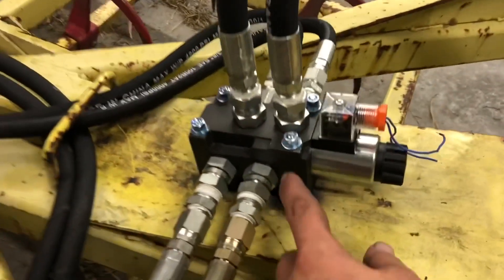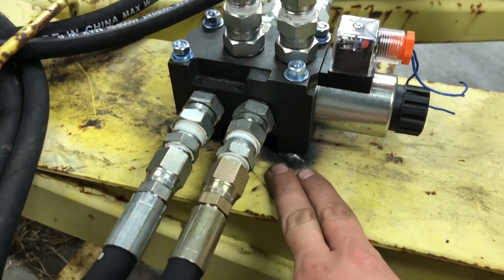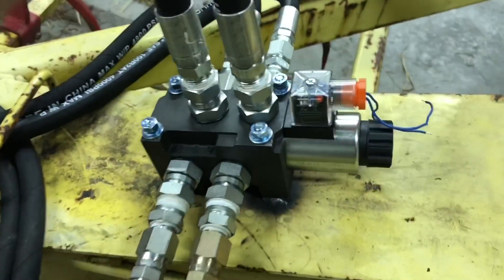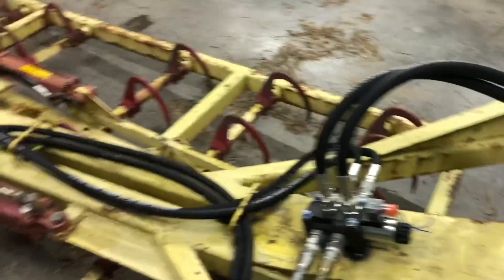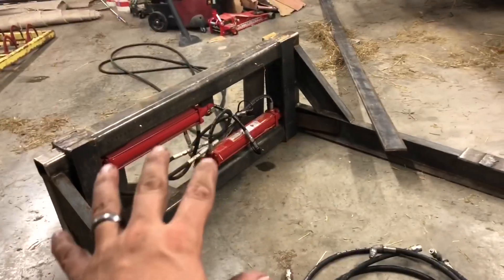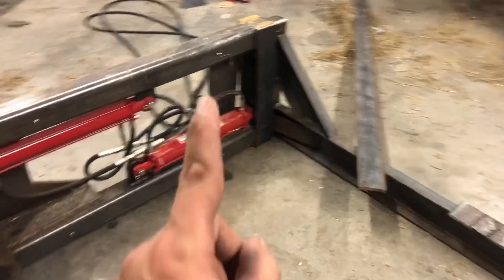What I did here is I took quarter-inch bolts by three inch, welded them to the frame, and just bolted this piece down - very simple. She's rigid. I don't actually have the cylinder hooked up right now because I don't have this working yet. If you remember me discussing the issues with the squeeze - there's one big issue and that is I bent my arms, which I 75% expected. I 100% hoped it wouldn't happen, but I should have just gone with my calculations. I used what I had, I at least proved the concept - it will work and it does work.